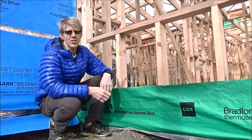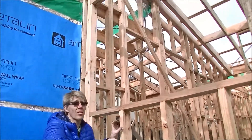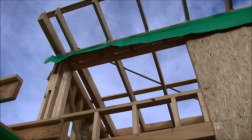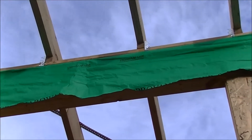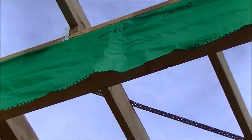It's not going to insulate as well as you want it to. Up the top you'll see a very similar setup — if you look up the wall, we've got a double top plate. We put the first top plate on, then a starter strip, and then we put our second top plate on, again to have something to connect to. So we've got a completely tight seal once we've taped up that wall.